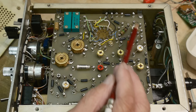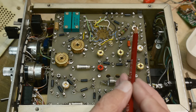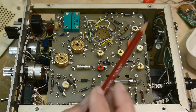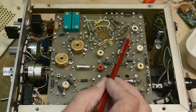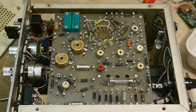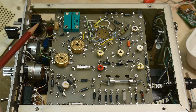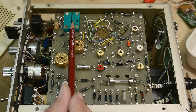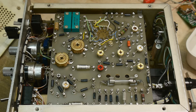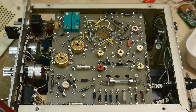It looks like there's an operational amplifier over here — one, two, three, four, five, six pins. Actually that's probably not an op-amp; that's probably a dual transistor with the emitters tied together — a dual pair. There's a hidden fuse in there. These two resistors are the calibration resistors; there's a cutout where you can reach in — one is labeled zero and one is labeled cal. These resistors are calibrating the volts and amps meter on the front.